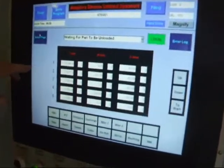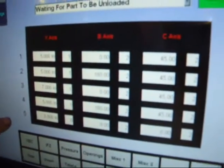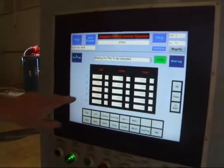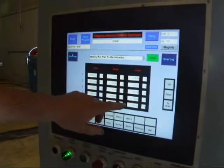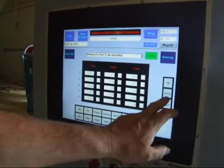Your edit page — this is where you write your programs. It's got five bends here on this page. You've got your B axis here — that's the rotation of the tube — the C axis, that's the degree of bend. You've got as many steps as you want to put in there.